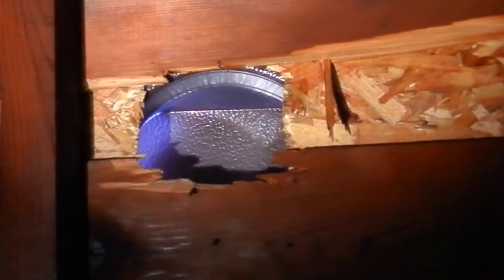Matt Fletcher here in another attic. This one's in Hamtramck. This house was probably built about 1910. It's another vent that isn't cut out to full size — you can see there's a vent there, cut out maybe to half the size it should be. That's really, really common.